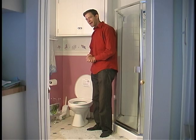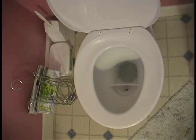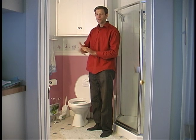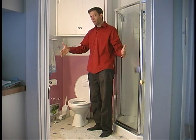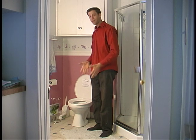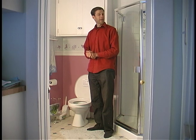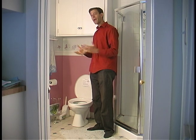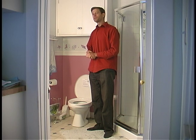If you take a look at it, what you have here is a separate chamber for the urine. When it leaves this toilet, it is combined with gray water from the sink and is recycled in the landscape. The feces go down to a giant box in the basement that is filled with worms, and the worms eat the feces. The flush water is then pumped out to the backyard where we have a bio bog, which consists of plants that evapotranspire 100% of the flush water. So what we have here is an Ecological Sanitation Human Nutrient Recycling System.